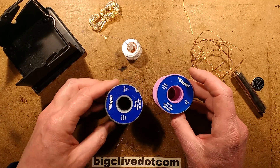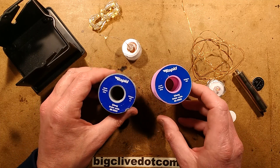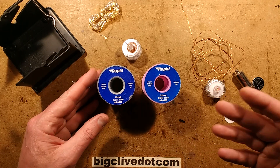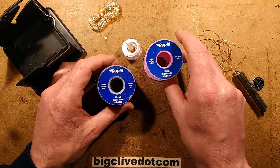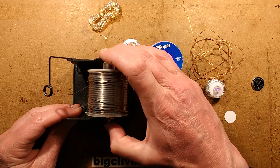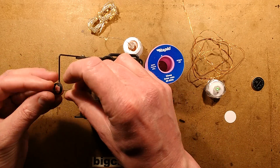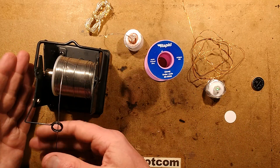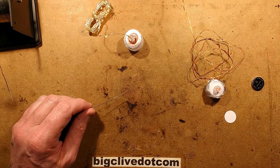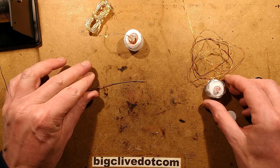This is also a time when I'm needing to replace my solder — this has lasted a good five years; it actually lasts a really long time. This is Rapid Electronics in the UK, part number 85-0595. It's a standard 60-40 tin-lead alloy solder. I use a little holder like this — you put the core through and sit it in the holder, it drops in by gravity, then you feed the solder wire through the little hook to keep it ready for use. The new reel isn't pink, but let's do this.